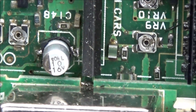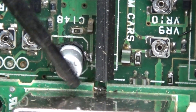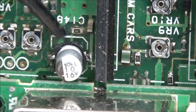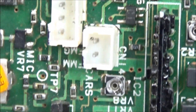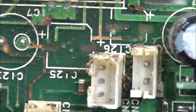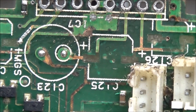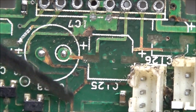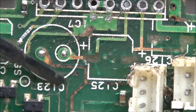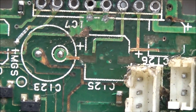Scanning across the board — there's a capacitor here that's very loose, just hanging on by a thread. What we'll do is take some very thin copper, cut it out to the sides of the pad, clean the board, epoxy it back down, connect the traces back up to where they're supposed to be, and then put epoxy over top of all of these after they're checked out. We'll see how bad the corrosion is.